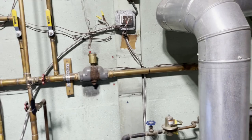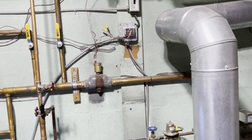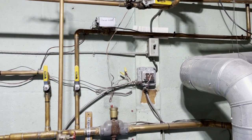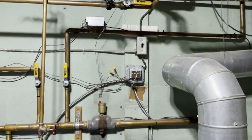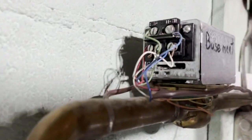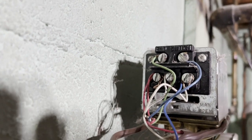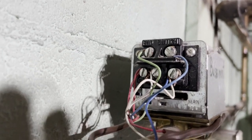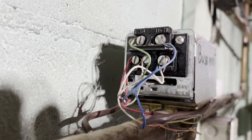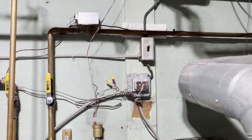Just to be clear, you do not need a separate 24-volt transformer — the one that supplies power to your whole system is plenty. You just need to find that extra wire where your 24 volts is constant. A multimeter set to AC will help you test for that: put your two leads across the red and white on the bottom left — that reads 24 volts when calling for heat. Red to blue on the bottom will give you 24 volts constantly, and that's where your thermostat gets its power.